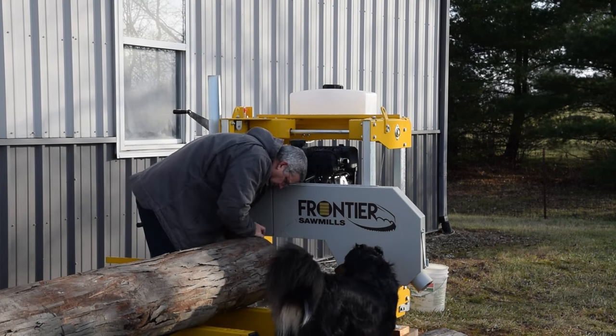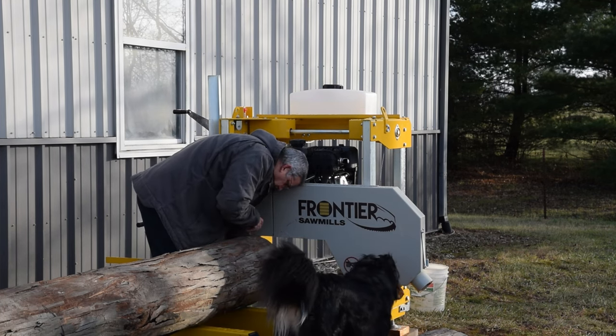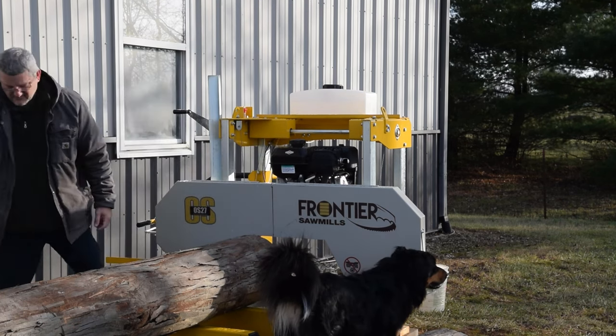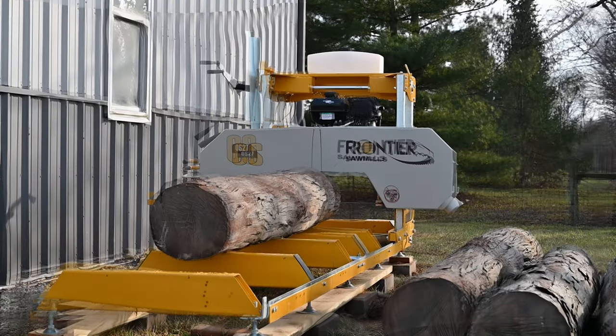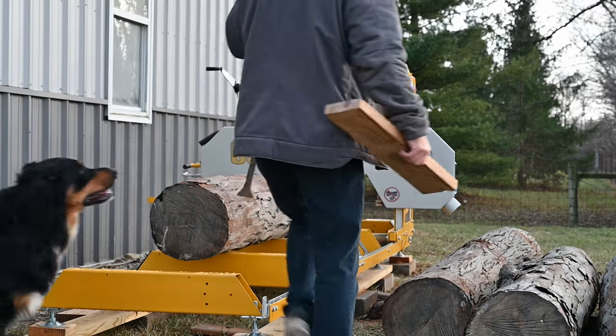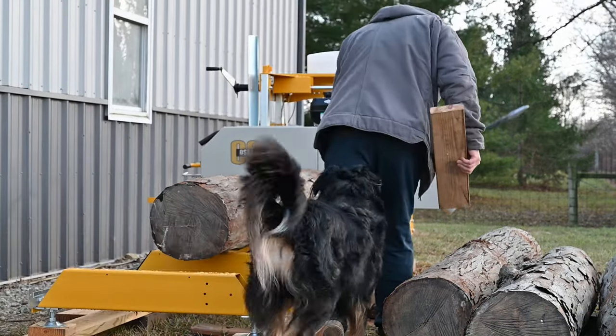The pith area has a greater tendency to crack than the rest of the wood in the tree and is unstable. Therefore, keeping the pith parallel to your cut allows for better lumber. The goal is to produce lumber with the best structural integrity and appearance while minimizing waste.